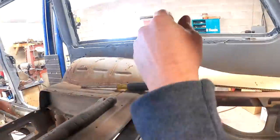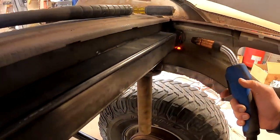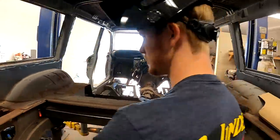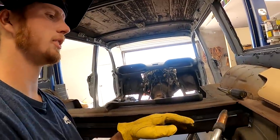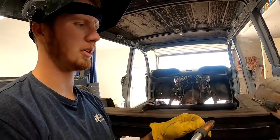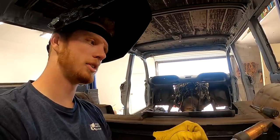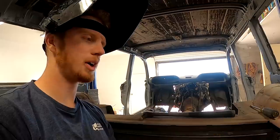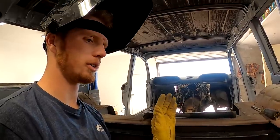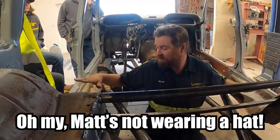I burned holes all over the place — Rudy, why is it doing that? I was putting the heat in and it was melting away. We put too much into it, we'll try again. It was too wide so it was getting too hot and I kept blowing through. So slow down and go on-off, on-off — build a bridge. You pause long enough for the previous bridge to cool, then go across it again. Once it's too hot, pause, and when it's ready go back over — the pool from when you're pausing you can pull across it.